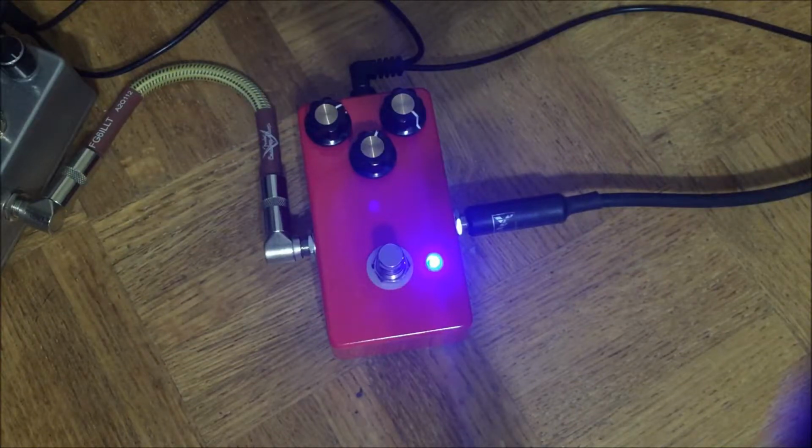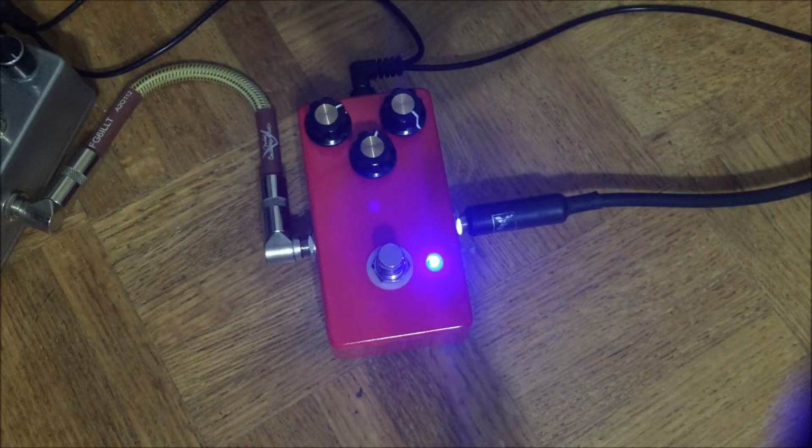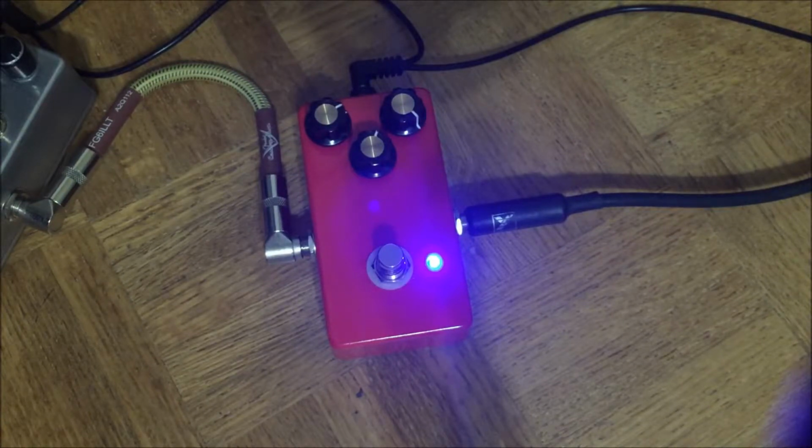So immediately you notice that it's fuzzy, especially at the top end, has a nice raspy sound that gives it a really hard edge, but it stays very, very tight. A lot of vintage fuzz designs, namely fuzz face and fuzz face derivatives, have a bass overload thing, which essentially means a lot of your guitar's lows enter the circuit without being attenuated, and then it can make a cool woolly sound, but it gets really flubby sometimes. Whereas with this, you can get a really tight low end, which is suitable for crunchy sounds and work.